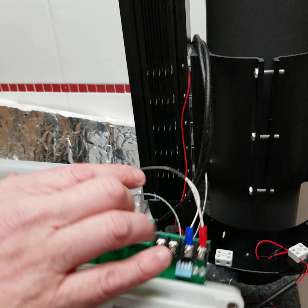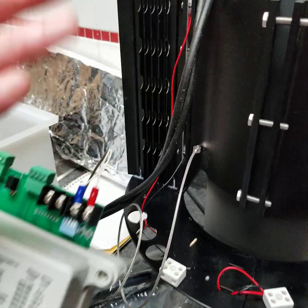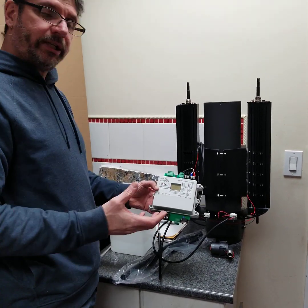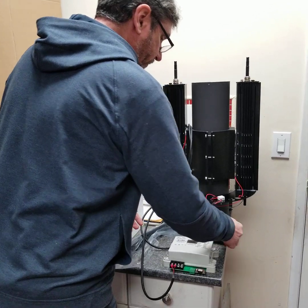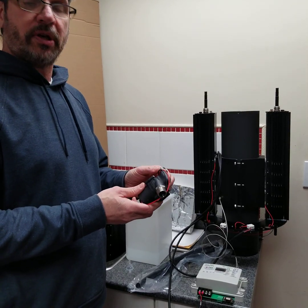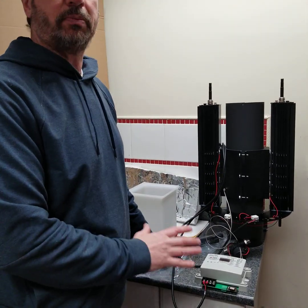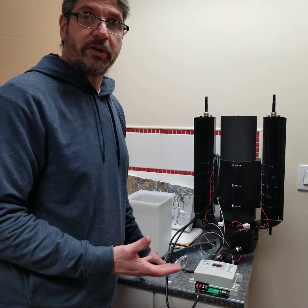This unit is hooked up to a thermocouple which is set at 100 degrees Fahrenheit. When the hot side goes below that, the pump will cycle five minutes on and five minutes off to conserve power. When it goes above 100°F the pump will continually circulate. The system comes with a 12 volt mag drive high efficiency pump — it's 15 watts but typically draws about six to eight watts depending on how you plumb it. In a closed system it'll consume under five watts; in an open system typically about 10 watts.